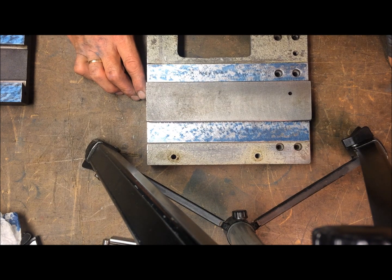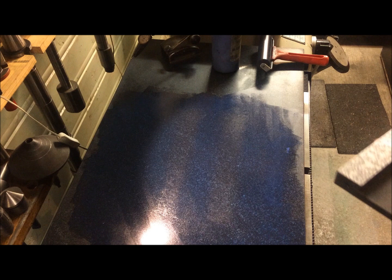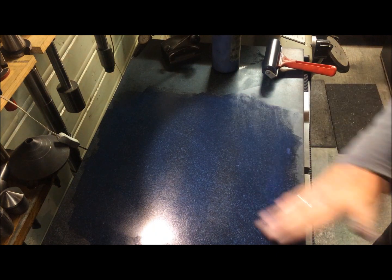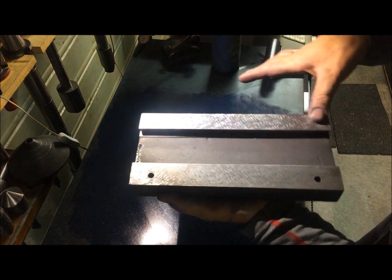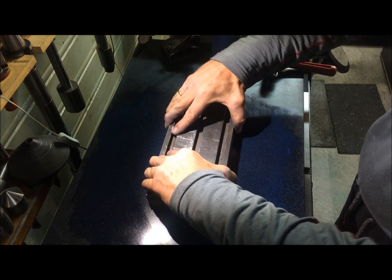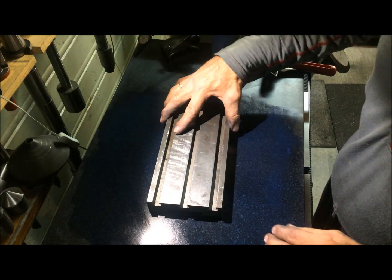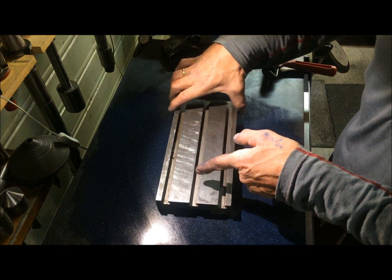Flatness is now okay and I'll go for a finish. Over at the small blueing table with the granite surface plate, I've applied some blue, wiped it off, and done the same on the table. I'll apply it to the granite plate — listen to the noise, like hollow — meaning there is no grit underneath. Wiggle it about so I can see where it hinges and pivots.